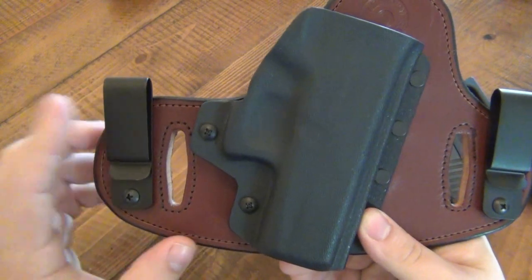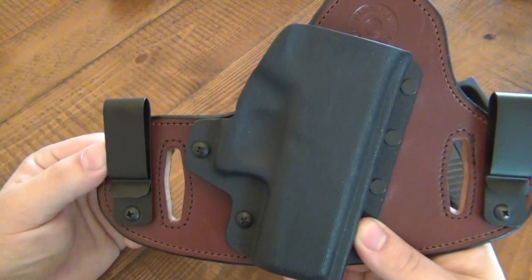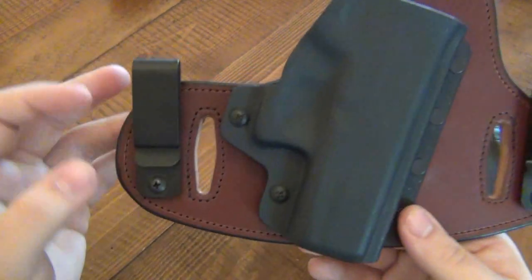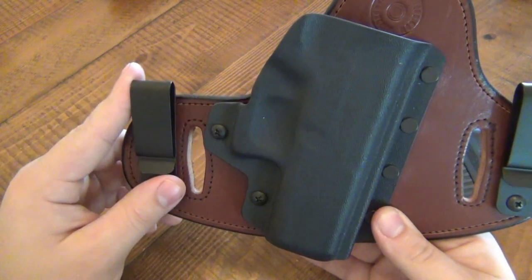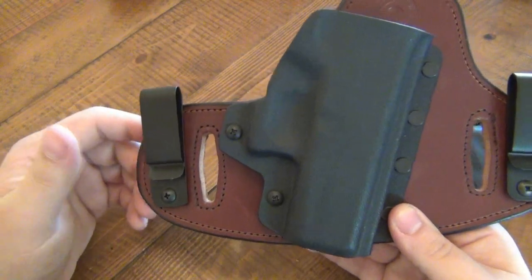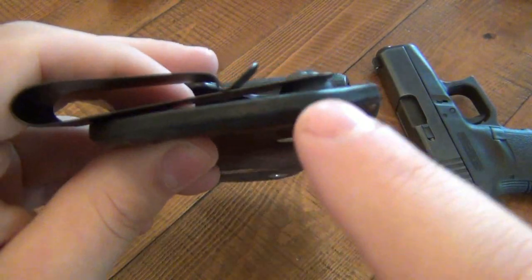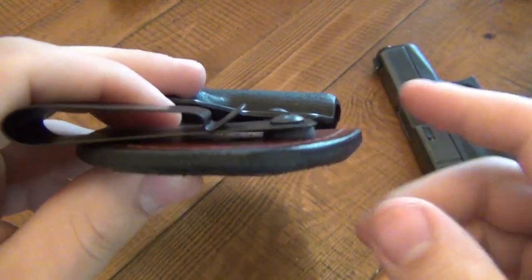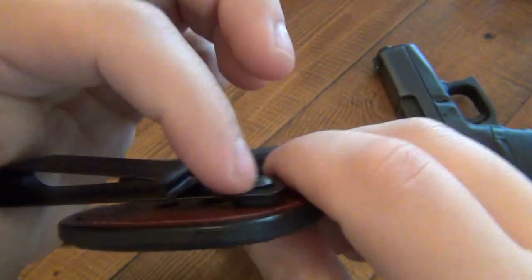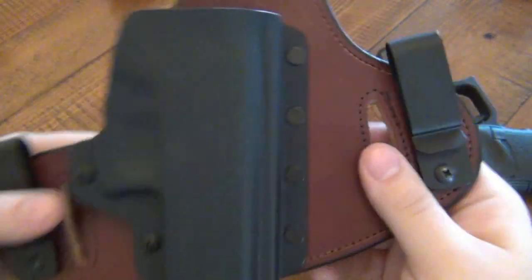As far as the clips go, you can order smaller polymer clips. The steel clips they offer — you can go to other websites for different clips since it's just a hole here, but as far as what they offer, the only ones are plastic. These ones are powder-coated spring steel. They work very well, they're very easy to clip on, and they do hold because of the shape — how it dips down and pops back up. The spring steel gives great tension; you can stretch them pretty wide and they still come back to original shape very easily.